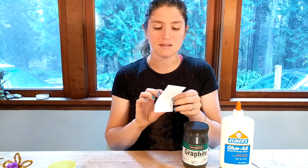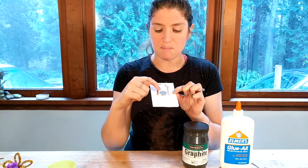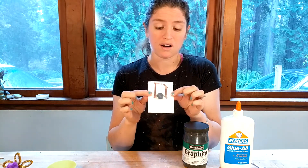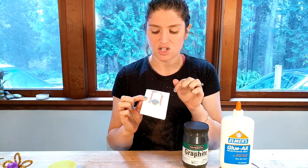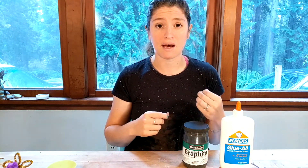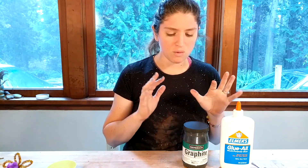The reason why we need it is sometimes when you make simple circuits on paper, they look like they should work but they don't. This is a little simple circuit — we have a battery holder with a battery and copper tape going through our LED and back to the battery. This should work. I've troubleshooted it already. The LED works, the battery works, everything's in the right alignment, but it doesn't work — probably because I don't have great connections. This is one of the things that can be really frustrating for kids when they're doing these simple electronics projects with copper tape and LEDs and little coin cell batteries. When things don't work and you've got to add 10 pieces of copper tape and you don't understand why because the circuit looks okay but it's not lighting up — it's really frustrating, which is why I make conducting paint.